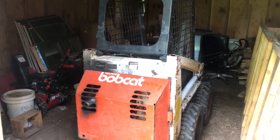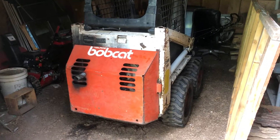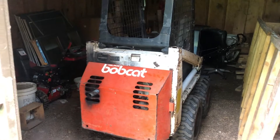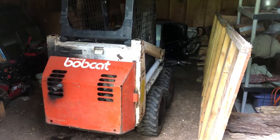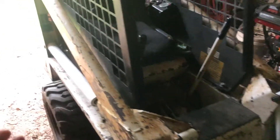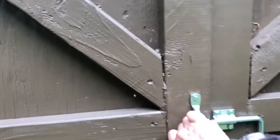This is my Bobcat 310 — it's an older model, very similar to the 330. A lot of what I'll tell you will probably apply to both models, and might work on other Bobcats with a piston that has only a single ring on it. There are others that have multiple rings and different grooves. The nice thing about both of these models is that the kits you buy for the cylinders are exactly the same — all the gaskets, o-rings, wipers, everything.